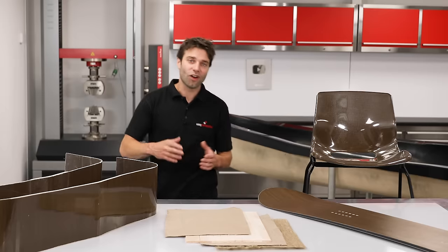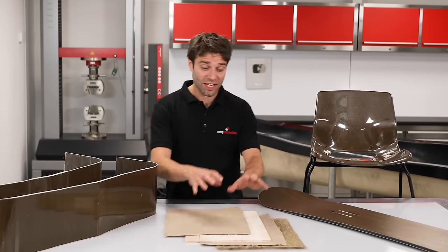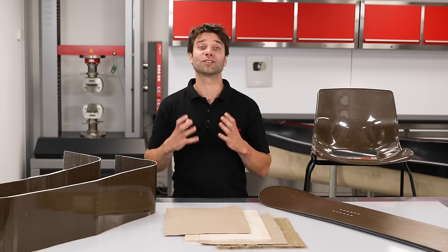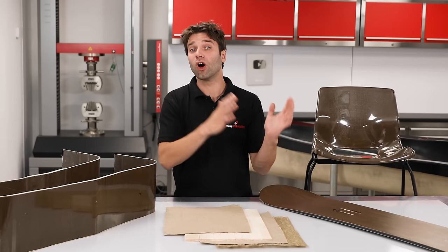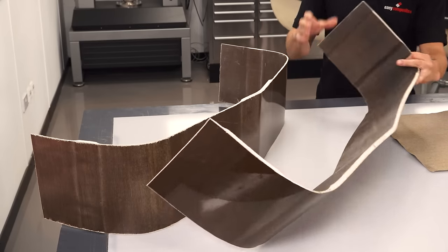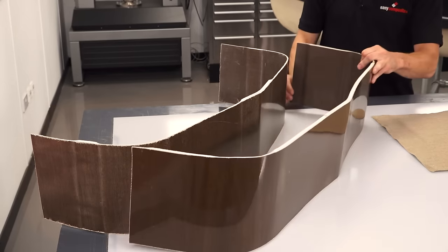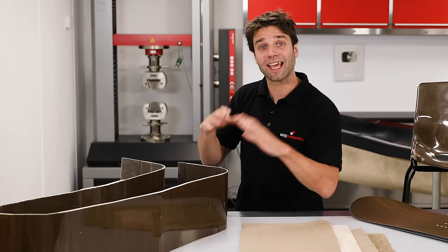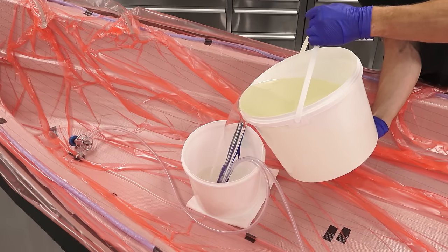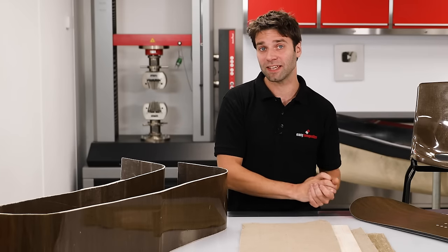While the release agent dries and cures we can take a look at the reinforcement. When working on a new project with new materials, establishing a suitable layup can be quite difficult. The method I use that doesn't waste excessive amounts of material is to conduct a small test sample on the mould itself. We've got two different laminate stacks here that have been infused as a cross section of the hull. These give us really good information on mechanical performance as well as data on resin consumption and infusion flow rate — both very useful for making the final part.